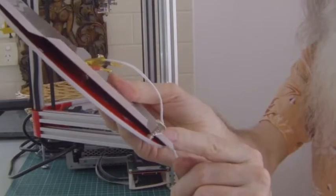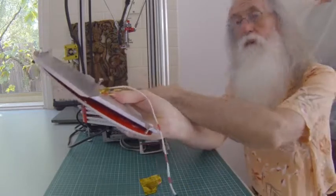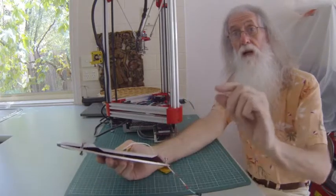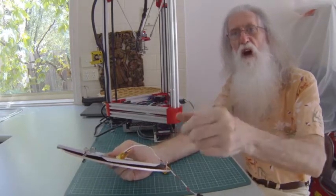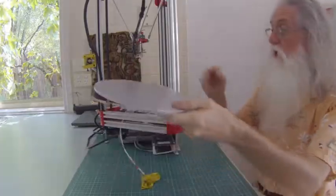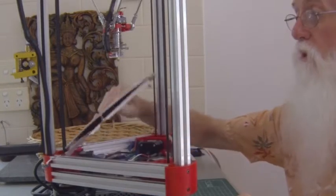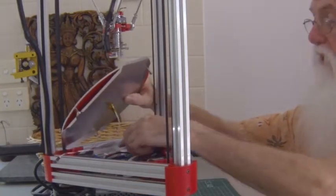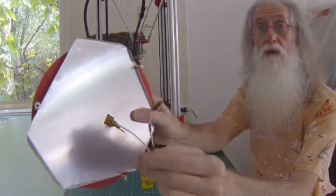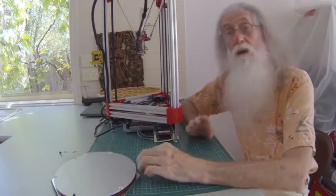The cable feeds in through the slot. There are cutouts that match the screws — I made them wider because the spring sits in the bottom on top of the nut in the channel. It's then just a matter of connecting the cables and tightening them up. When I want to remove the hotbed I just undo the screws as normal and lift the whole unit up. There's enough cable length to hang over the side, and the thermistor has a JST connector so it comes off as a unit.